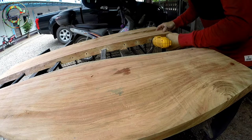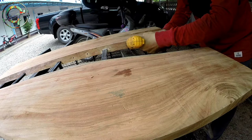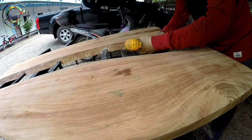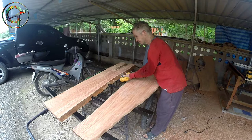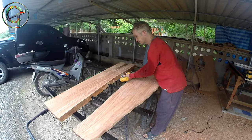Solid slabs, like the one that I'm assembling, aren't totally stable. Sudden changes in temperature, humidity, moisture, liquids generally speaking, it's a kitchen table, all are factors that could make the table move. So, steel inserts and all the other precautions are necessary to achieve a product that stands still for many years without any kind of problem whatsoever.